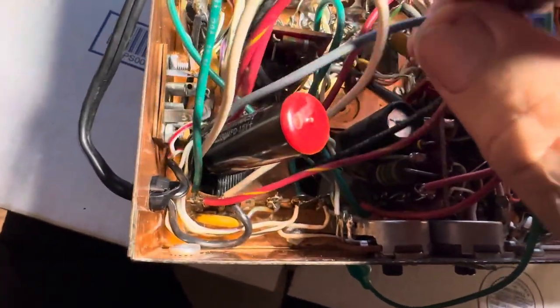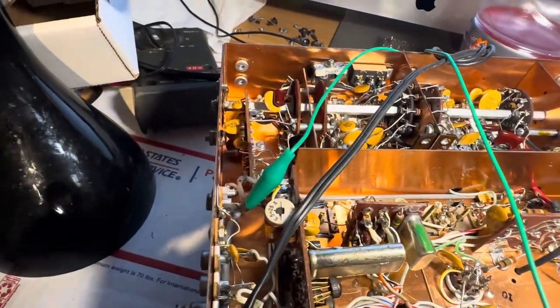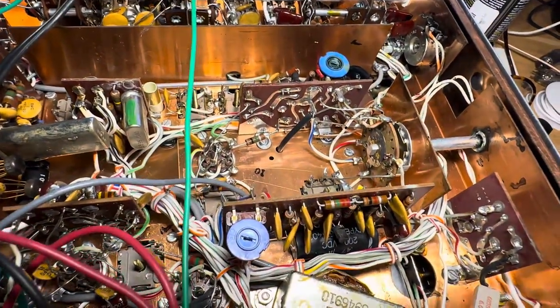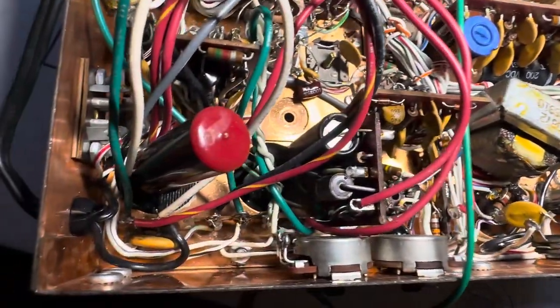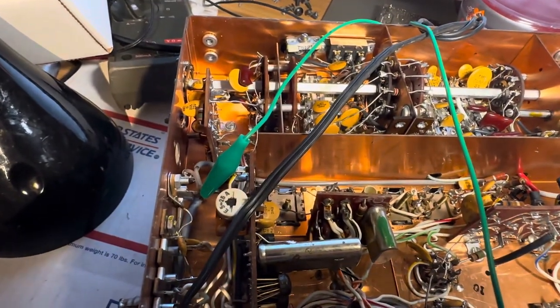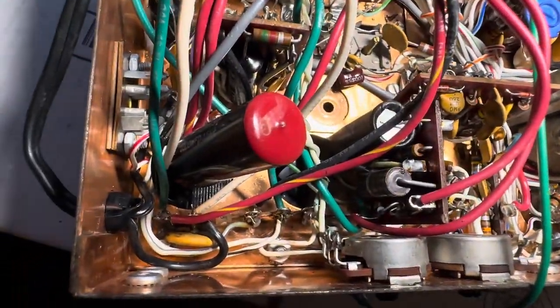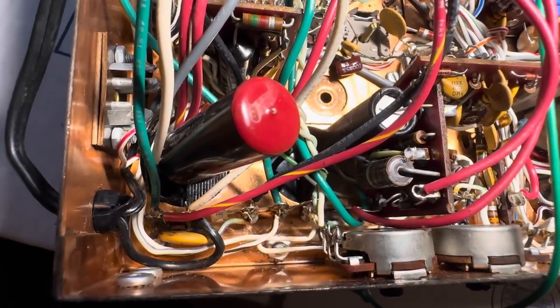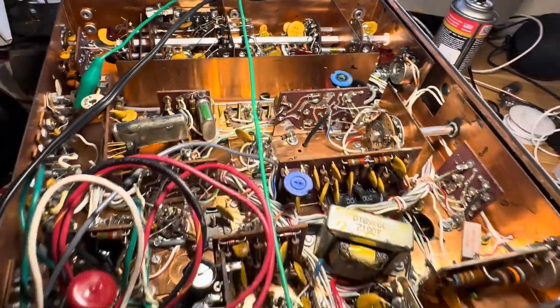I don't like that I left those wires here, but I wasn't sure the transformer would work — and I'm still not sure. The test is to leave this radio on all day; if it survives and the transformer doesn't melt down, put a very small fuse in here, maybe run it in the garage where it won't catch anything on fire. The transformer is undersized, but I couldn't find one with a 250 or 260-volt center tap — this one is a 300-volt center tap. It's probably overpowering the radio a bit, but it has two amps of filament current. That's my little lecture on the Drake R4B.